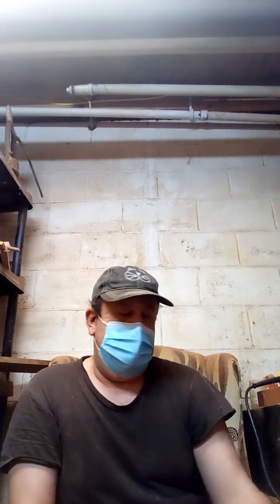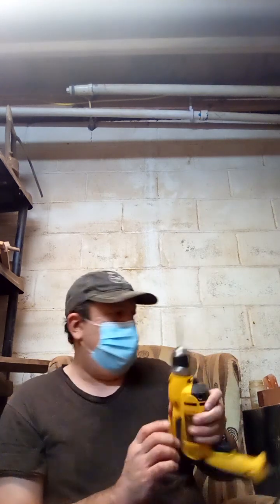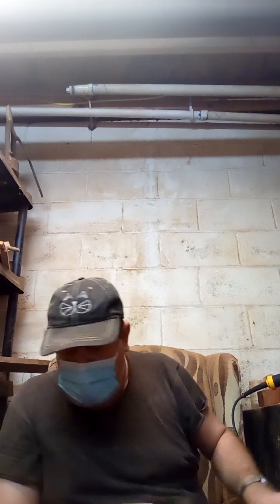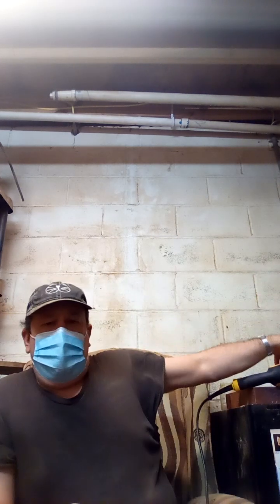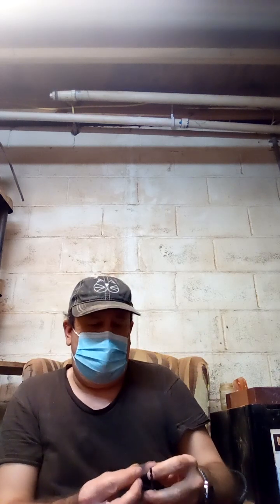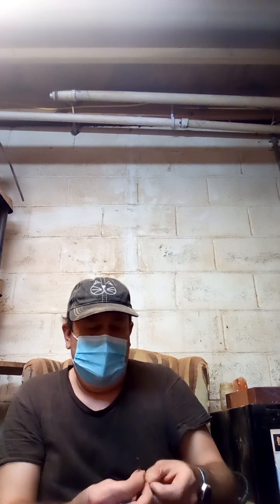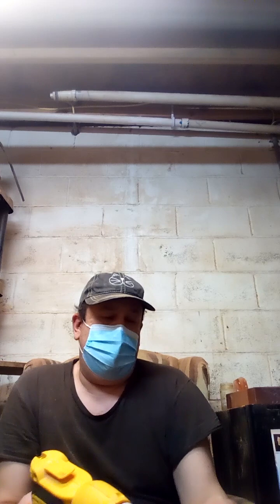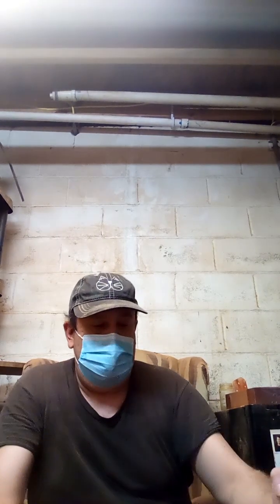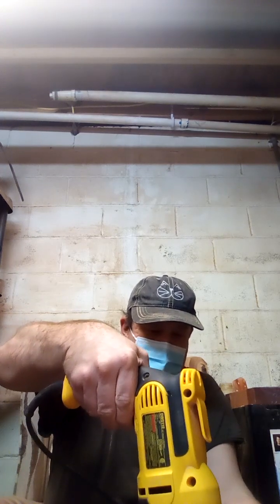Here is where I got that little X in the middle. One little thing we also do around here — I thought I had brought some scotch tape over here. Didn't know what I did with it, had to stop to find it, but sure enough I did. Where we only need the drill to go so deep into the wood, we make a little mark right here at only the depth the bit needs to go in the wood.